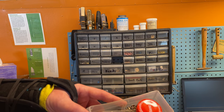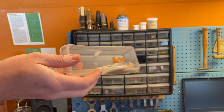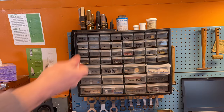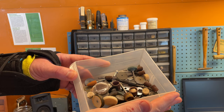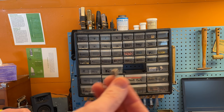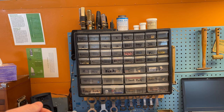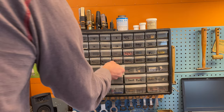Here are rivets and my rivet setting tool. Felt, synthetic felt, Teflon tubing and sheet. Hospital tape — like band-aids — and liquid bandage to paint on your skin, which is super helpful in this job. Various Dremel bits — mostly I use the tiny miniature buffing wheel, the silicone discs, and tiny Dremel bits to drill out lock screws on Conns, which I do quite often.